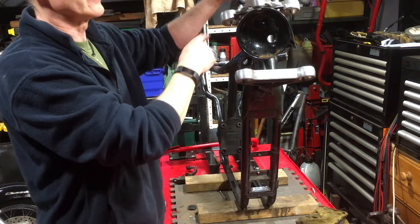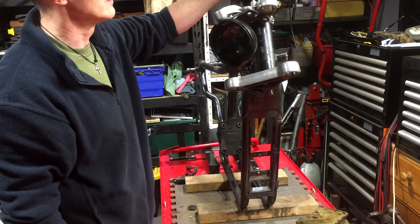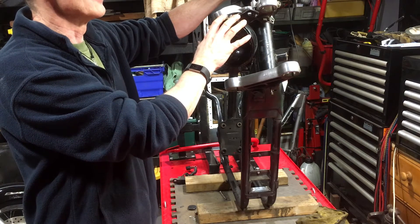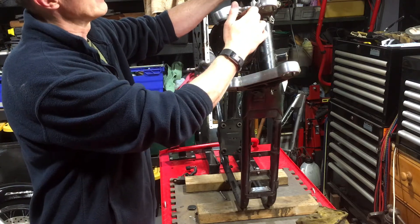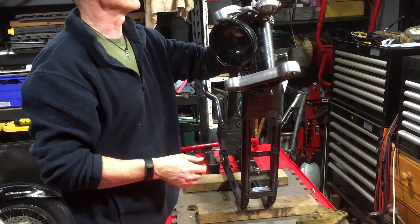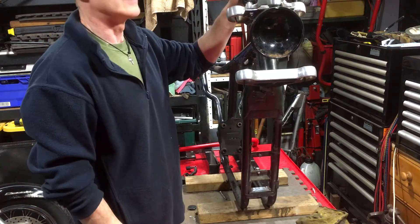So there we are. I realised early on that I made a mistake in welding these nuts on at that early phase — that was a big mistake because it's made my life much harder in fabrication. What I should have done was to have left them loose, just put nuts on, even though that would be a little more fiddly in the assembly phase — because what's happened is I can't put that plate of metal flat when I've been cutting it. For that reason I am going to weld these nuts on for the front ones, just so it gives me back a level surface, but even so it's far from ideal — that was definitely a mistake. Now let's test the functionality: lock to lock with no problem, no interference. This is in the fully back position at the moment. Right, let's get those nuts welded on.